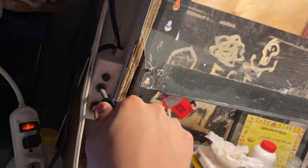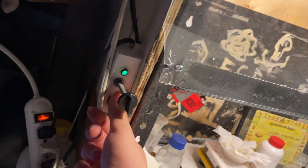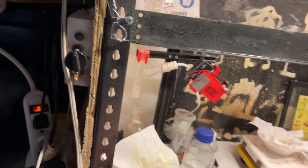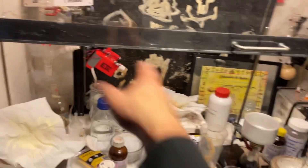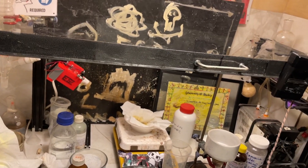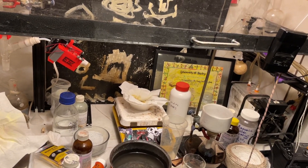Here's the fume hood blower control. I have a light dimmer in here — I just reassembled it with different stuff, also smaller. It has adjustable speed, and then the emergency setting where it just turns on to full power. The light switch is corded on here. The fume hood is 4-foot by 2-foot by 2-foot — it's perfect for now. Might need something larger in the future, but I think this will last me for at least a couple of years.